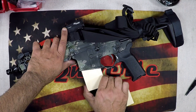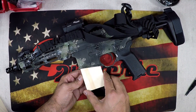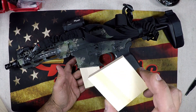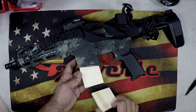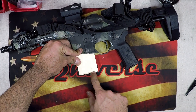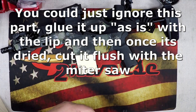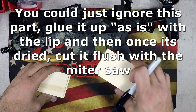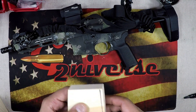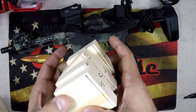It's going to sit like so in there — make sure it's seated all the way to the bottom, bottoming out and hitting up against the bolt carrier. Then you're going to have your mag block sitting like so. If you cut the bottom piece to three inches you may have a little bit of a lip at the bottom. Just set it up as it normally would, grab a Sharpie, mark that line, give it a trim, fit it, glue it, and sand it on the belt sander to get it nice and smooth. That's why we over-measure — so we have room for a really good fit. Then it's glue time.